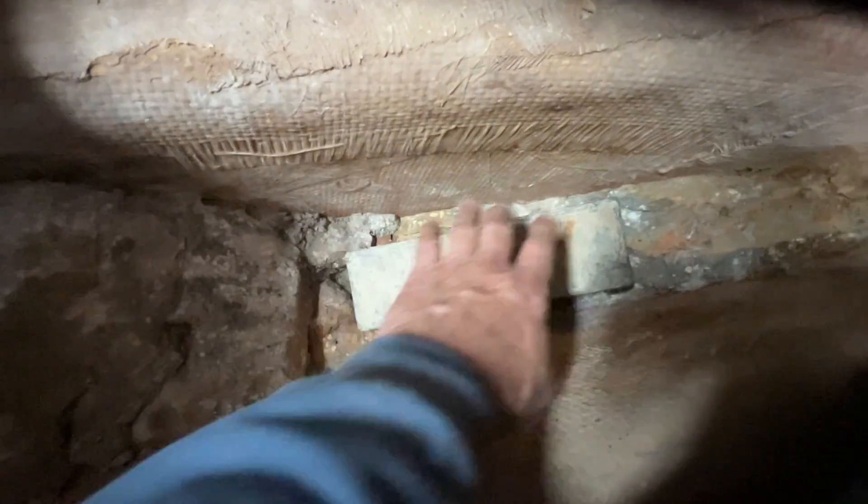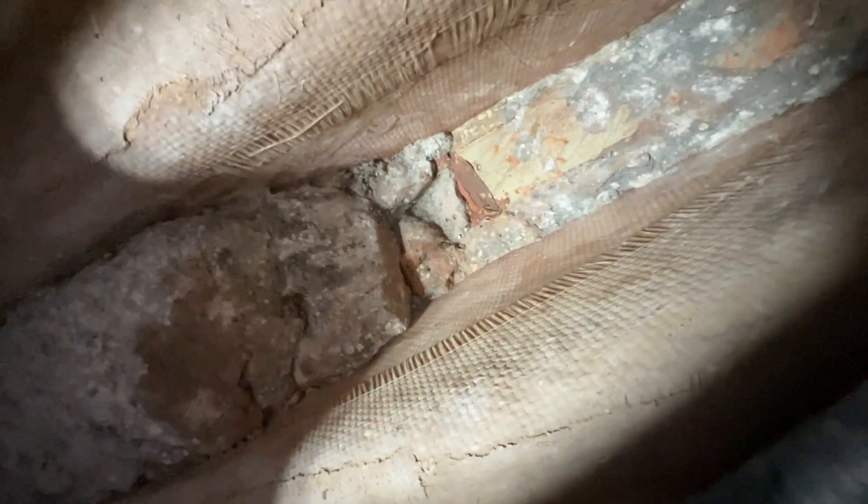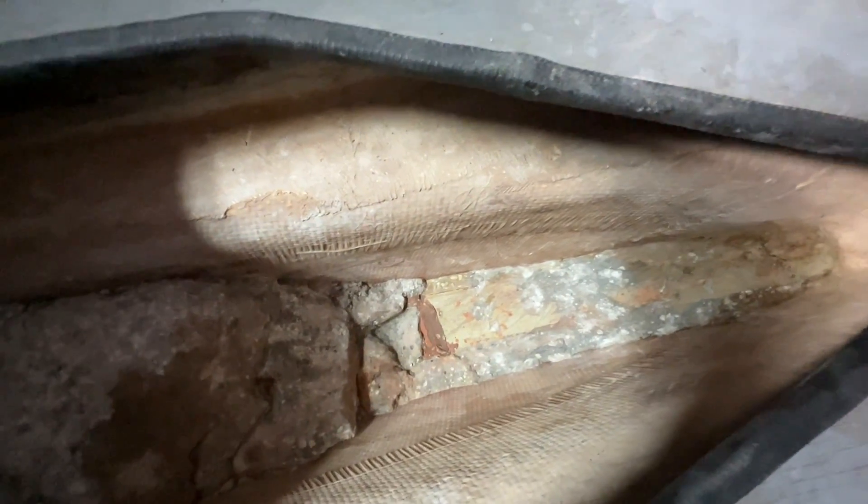I'll put a little concrete down in there, then set the lead down in just a little bit of concrete, and then pour the concrete around it so that there's no air cavity anywhere. I'll put two of them in there. I took out 30 pounds of lead and I'm going to put 50 pounds of lead back. I haven't weighed my concrete yet — I've got to do that next. I'll get concrete with pea gravel size gravel in it to make it a little bit easier to conform and pour. I can always add a little more than 50 pounds of lead using the clean chunks that came out of the boat.